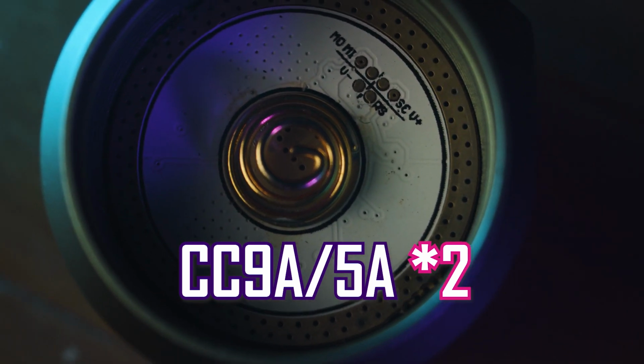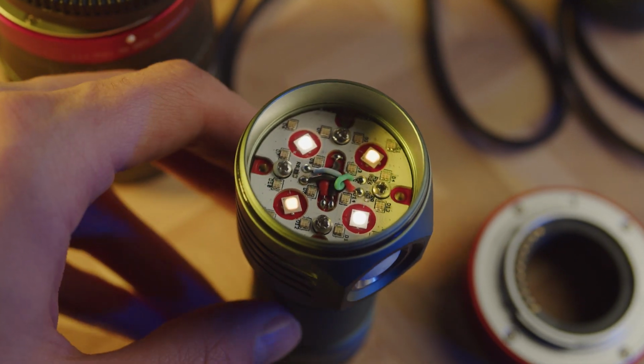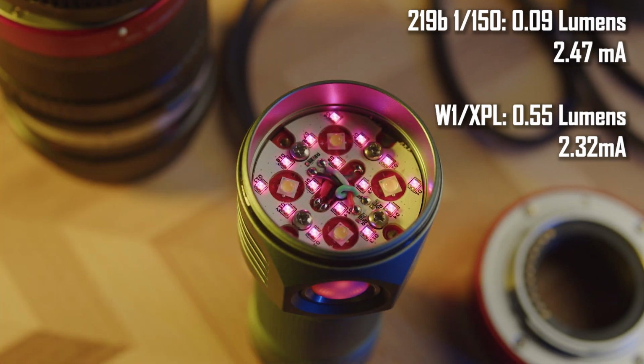This is the same linear driver architecture found in other Hank lights, with the same quirks as well. Namely, the lowest modes are very low, but are a bit unstable. The driver does get to take advantage of Toykeeper's latest firmware update that adds some extra granularity into the ramp.